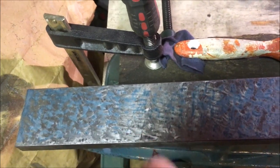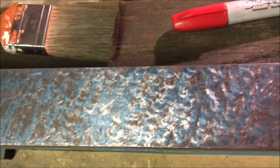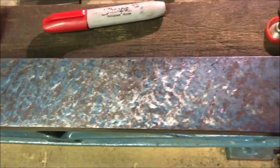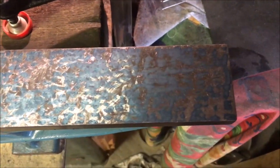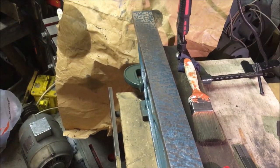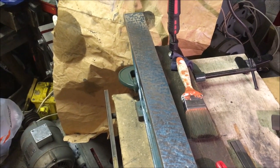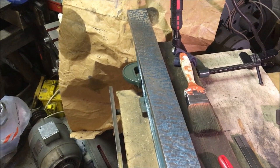So we're a little bit light in that area. But if you look at the size of the curling and the scrapes, they're a bigger radius on this end. Moving down to the middle, you can see the curling's getting smaller, so there's more points per inch. So the plan now is carry on doing that sort of double print and get the curls as small as I can and lift the points per inch, aiming for something like 25 points per inch and ideally 60 to 70% contact.